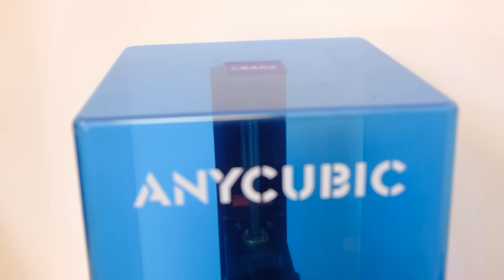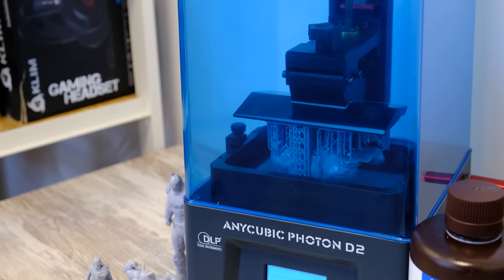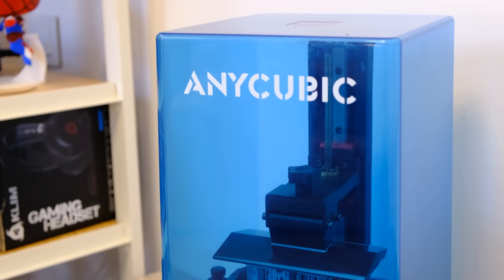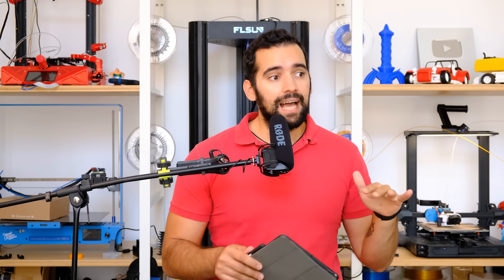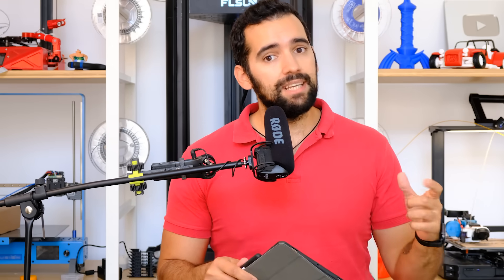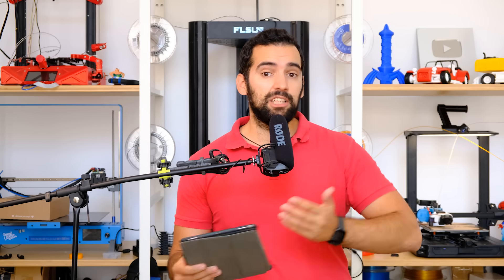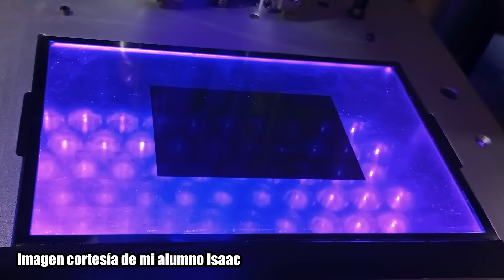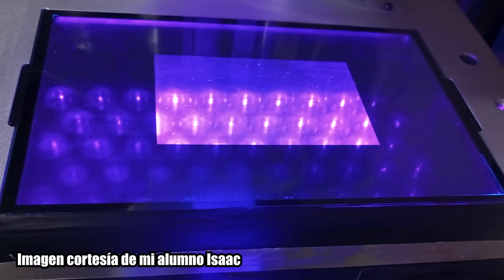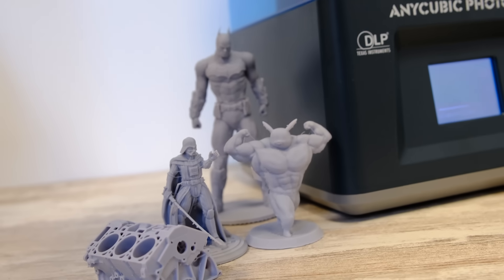This system has advantages, for example, it does not have light leaks. Let me explain: in an LCD screen printer what we have is an ultraviolet lamp that opens on each layer, and that light has to be dimmed by an LCD screen — either monochromatic or normal. To be dimmed by the entire light source, there may be some pixels through which light escapes, even if they are completely closed. This is a phenomenon that in some cases happens more, in others less, but more or less it happens in greater or lesser measure in all of them, although it is not always appreciated. In this system, the light is already much more stable and much more controlled, and this effect of light bursts we do not have at all. The tank sits on a glass, a silicate, but we do not have, as such, a screen filtering it — it is the same source of light that is projecting the layer.